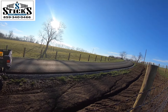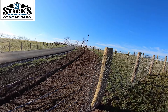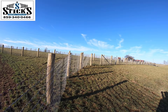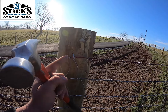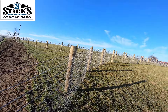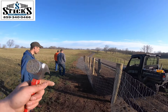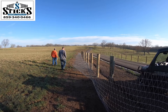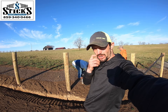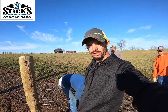So what we've got is we've got our curve pulled hand tight, and we're leaving these out so that when we go to do our next pull — which is on a straight stretch — it's going to pull this staple, which is usually going to end up around this area, and it doesn't take much to get this stuff tight. We're going to go down here to the next strut which is down at the far end and prepare to pull this straight line which will pull our curve out. What Chicken's doing is putting our strainer stretcher bar together so we can make our pull leading up to our curve.